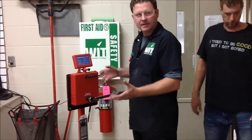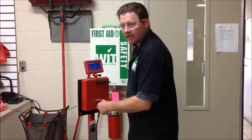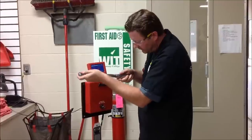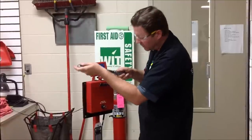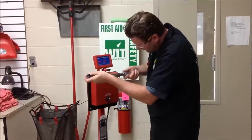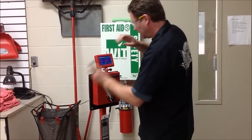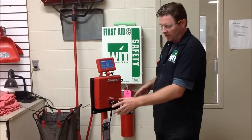So I'll hop in here. This isn't my tool, I don't know what it's going to feel like — it should be pretty consistent no matter what. I'm getting 60 every time. To prove a point, I'm going to move it down and pull it back up and make sure. I verified it was at 50 before, but I'm going to set it to 40 this time. This is a little hard to read — I should probably use foot-pounds, that would be a good start. Okay, I'm at 35... and I'm at 40. We'll see what I get. Ready. I got 50.